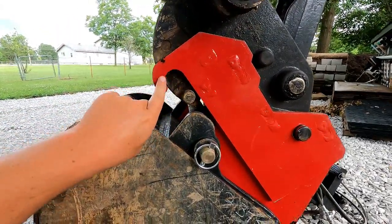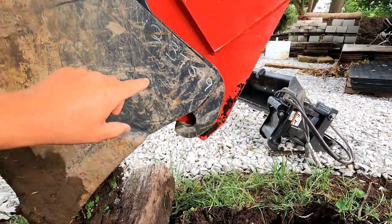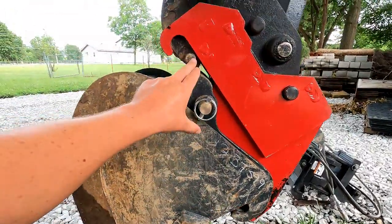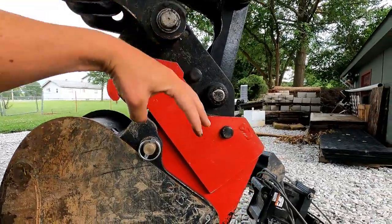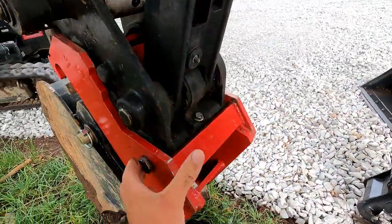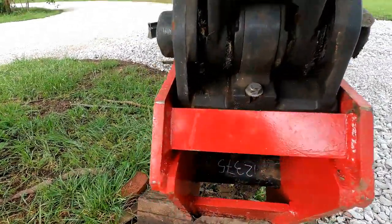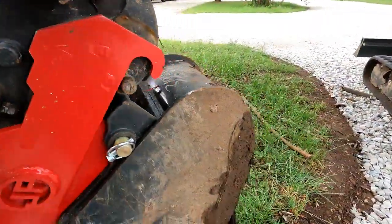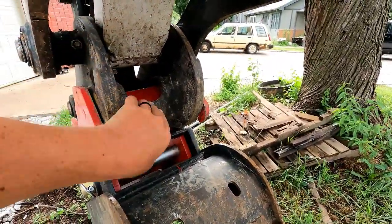These hooks do seem to be a little bit more elongated than these hooks, but that really doesn't affect anything that I've noticed, because that's simply where this little hook hooks on here to pick up the bucket, and then that's where this J hook slides into place. And really this pin is the integral piece. As long as this pin is put in place and it has this little bar right here to put pressure against, that's what holds the system together, as well as this J hook hooking around.